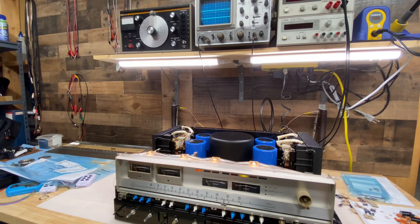All right, the tone control and flat amp boards are done. I have a 15 kilohertz sine wave at each auxiliary input, and actually we can see the auxiliary LED is illuminated. Good to see that's working, as is the speaker A output LED. So let's start with the volume. We'll turn that up. That looks good. Let's check the muting switch. Also good. How about the balance?